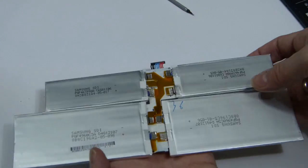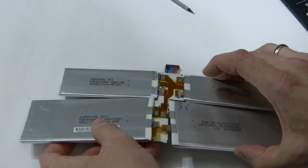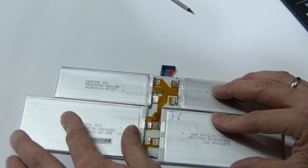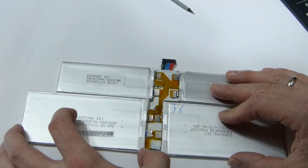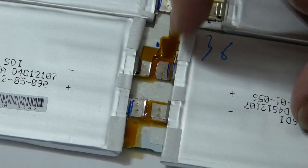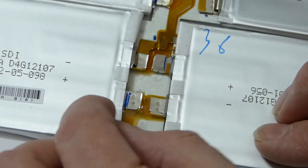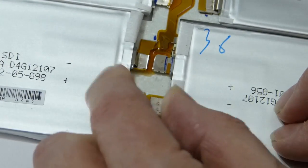This one died, and I'm having a look to see if there's anything obviously broken — like any connectors. There's one possible broken connector: this connected to this. I wonder whether the batteries themselves were okay but the connections broke between them. Let me zoom in and show you what's happening. These are not connected at all in any way to anything, and if they're in parallel, that's the plus and the minus.